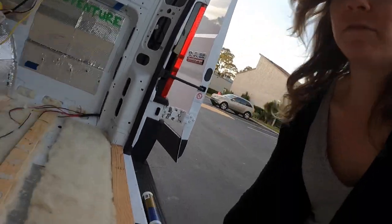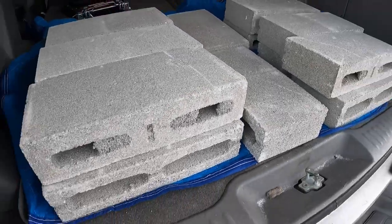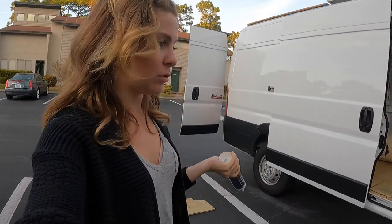Here's what's happening: the glue isn't all the way dry yet. Because we didn't have enough weight on it for long enough, the boards are just popping up and off. So we're going to put more glue down and let it fully cure. We got our weights and the extreme liquid nail. We are going to take the boards out again.